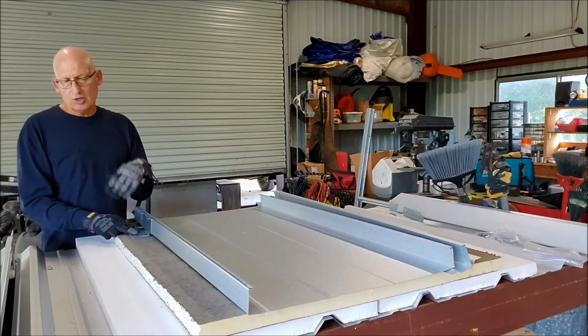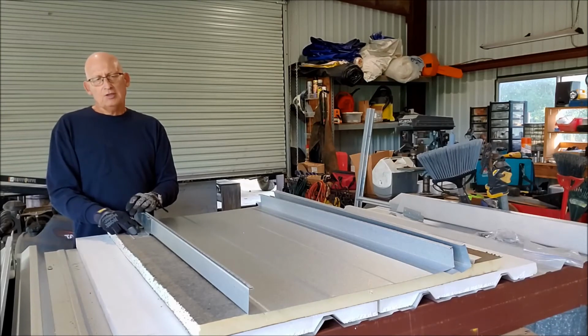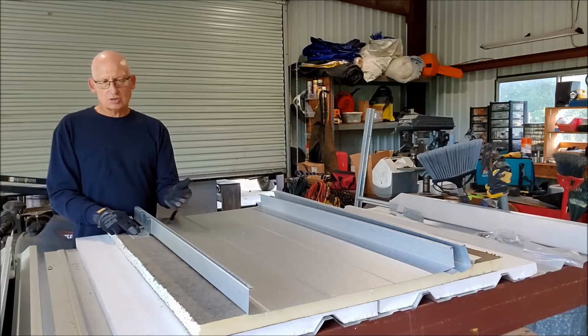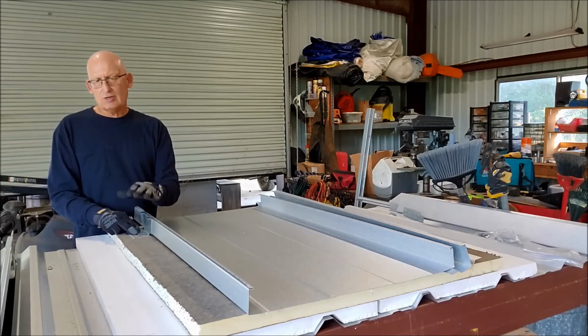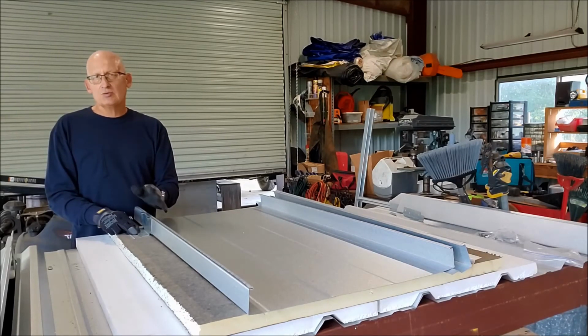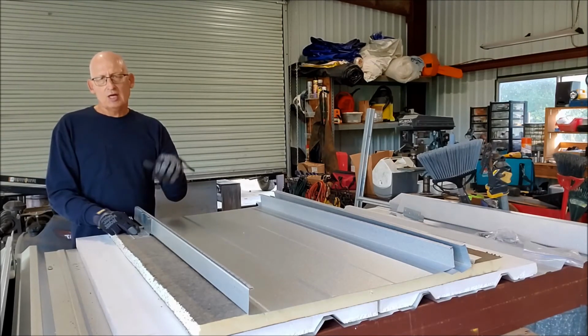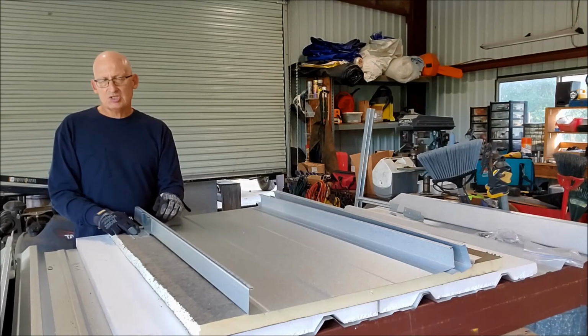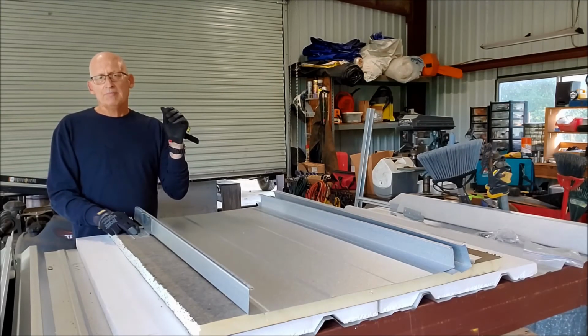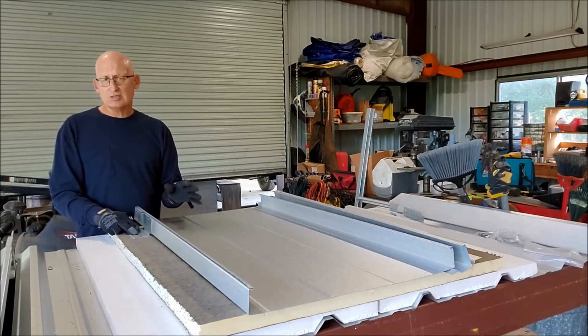So this can give you a really good installation of a watertight roof. You're not going to get any structural enhancement. You're only adding weight, so you want to make sure that you get straight with the engineering to make sure that the roof is good with having this weight added onto it. But this is a great system for high wind uplift, if they want continuous insulation, and they want to be watertight the whole time. So this is a good system for those kind of situations, right?